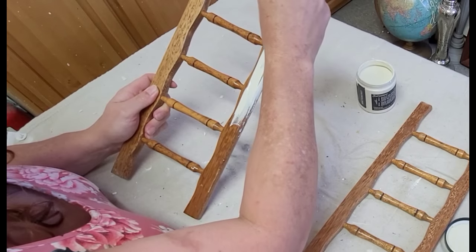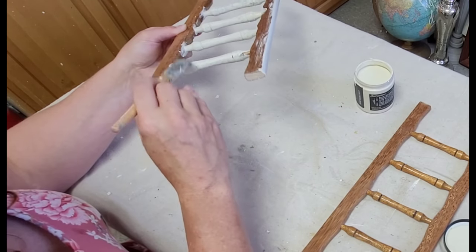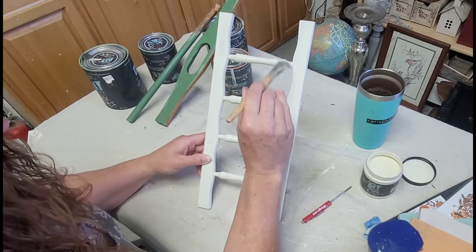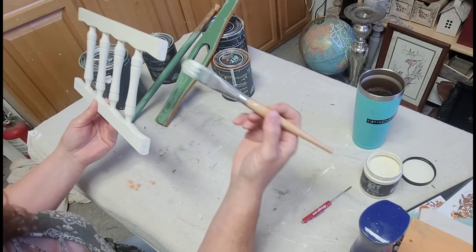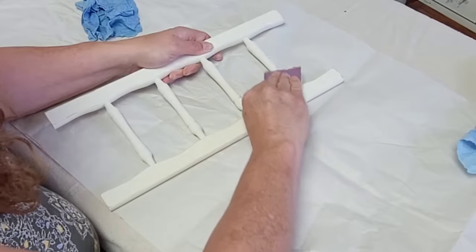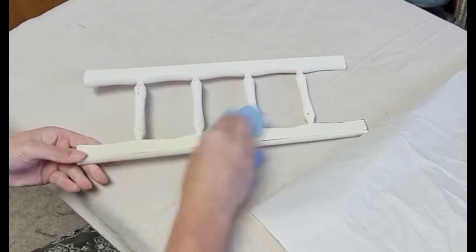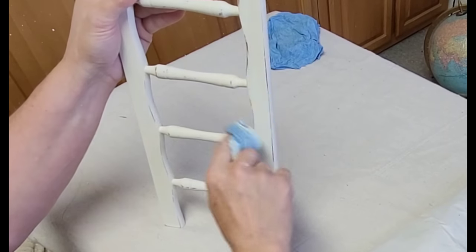For project one I'm creating what I call a miniature blanket ladder — so cute to hang on the wall for napkins, doilies, or jewelry. I painted this first one with DIY's Crinoline, applying two good even coats to get it completely covered. Once done, I laid paper down to protect my drop cloth and sanded with 220-grit sandpaper to get it nice and smooth and distressed. Then I went over it with a damp shop towel to clean up the sanding dust and do a little more distressing.